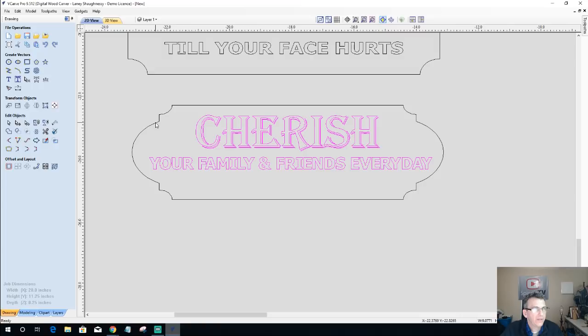Let's increase the clearance gap to an eighth of an inch since I'll be putting tabs on these. Always click OK to confirm and lock it in — don't close without clicking OK. On sheet one and sheet two in the nesting tool, if you don't have nesting creating a second sheet automatically, just create two separate layers — sheet one and sheet two — and lay them out individually on your board by rotating and positioning manually.